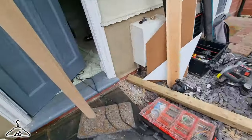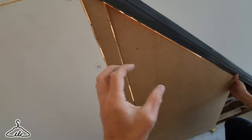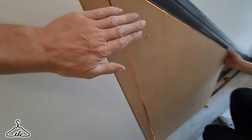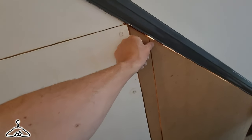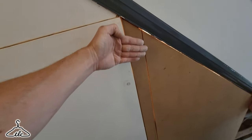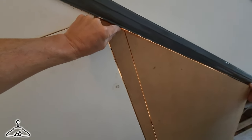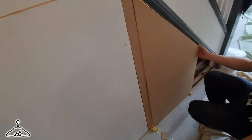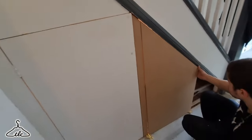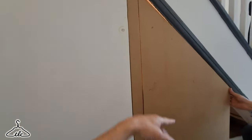The reason we're going for inset hinges is that they have a bit of a kick to them. If we need to adjust this door in and out and there's no frame behind, that's our reasoning. If we went for overlay, the door would be over the frame behind, and if we had to adjust it in and out there are limits because of the frame at the back. With inset hinges the door can adjust in and out as far as we need it, just in case there are any twists on an old wall. We'll just tack it for now with a couple of pins to make sure we're happy, then start hinging.